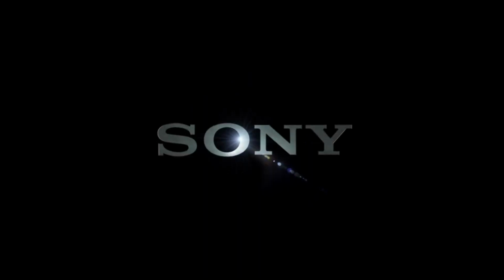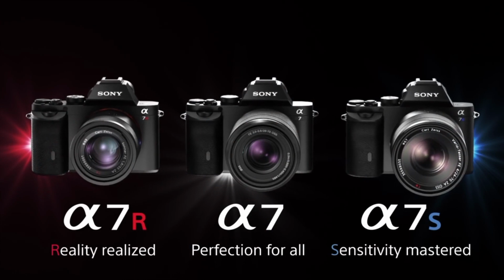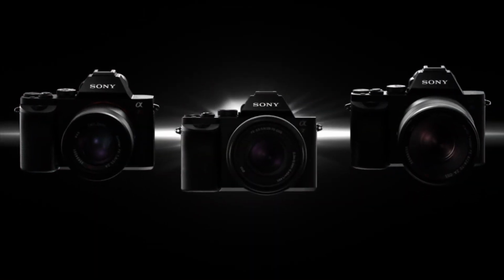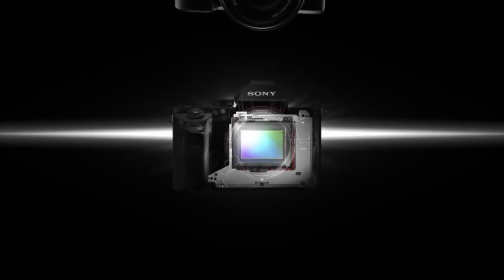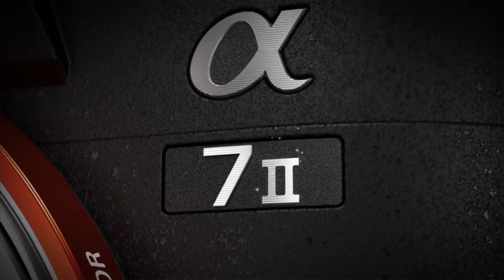On the video front, it shoots 1080p Full HD video up to 60 frames per second to the AVCHD 2.0 or MP4 formats like the predecessor, but new for this release is the updated XAVC S codec, which increases quality and reduces noise. It also features the S-Log2 Gamma, increasing dynamic range, and zebras as well, plus it outputs a clean uncompressed HDMI feed for use with external recorders or monitors.